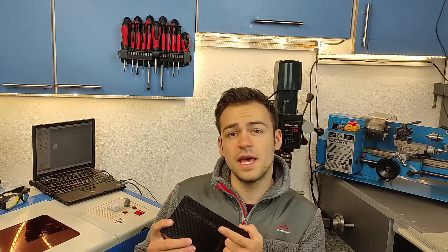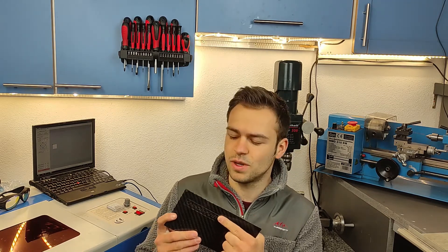So actually you can't cut or engrave carbon fibers, but you can engrave or cut the epoxy layer — that is what you can see here. After many tries I couldn't get through the carbon fiber plate, so I think cutting carbon fiber with a K40 CO2 laser isn't possible even with a fully upgraded laser. But engraving a carbon plate like this is definitely possible.